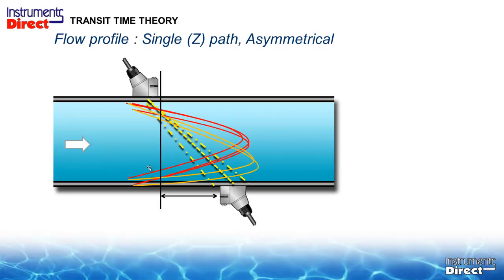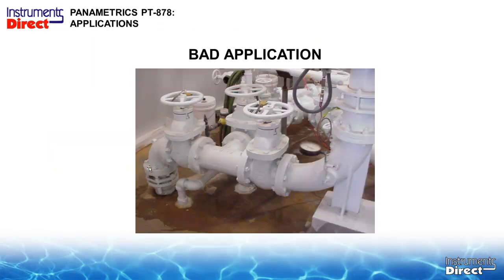With more disruption and a variable flow rate application, the mean velocities move all around inside the pipe. You may come out Monday morning with low flow rates, move the sensor to get a reading, then in the afternoon the flow rates are higher and you have to move the sensor again. When you see a bad application like that, the only option is to go upstream or downstream — and in some cases you may actually have to bring out a backhoe to find a good installation point.